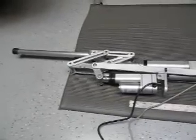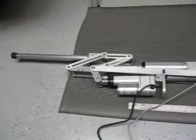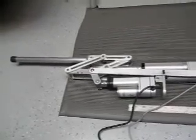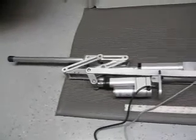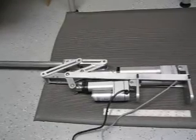The motor itself actually moves at about one-half inch per second, so four seconds for a full throw on that particular part. Now, this is laying down — this would obviously be a vertical leg — and right now we're just testing the movement and making sure everything is tight.